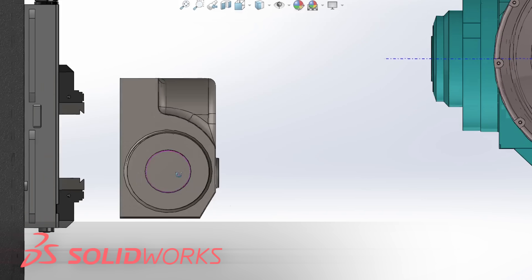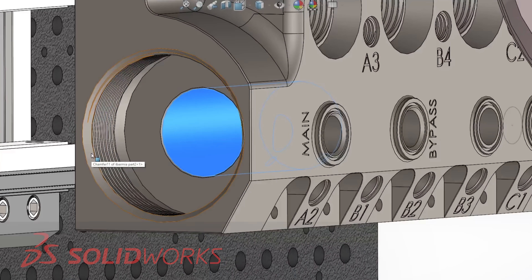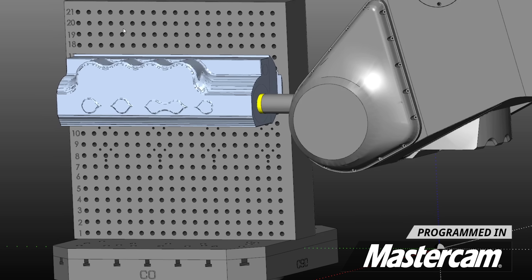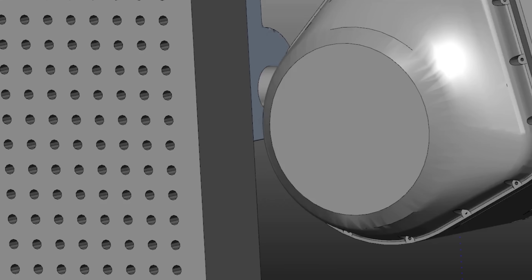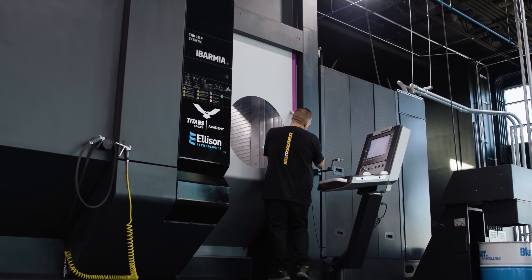On both ends of this part we have a hole that's 9 inches deep, and we're using this drill that only has a 6-inch max depth of cut. The reason we're able to get away with that is because we have a big counter bore on both sides. So we're going to come in and drill 3 inches deep, then come in with our end mill and machine out the counter bore. Then we'll come back in with this drill and shove the whole tool holder and everything into the counter bore to get that full 9-inch depth.